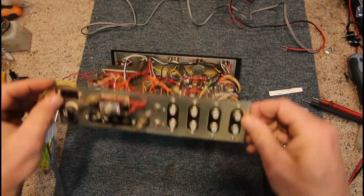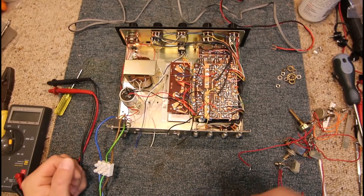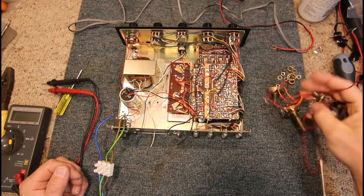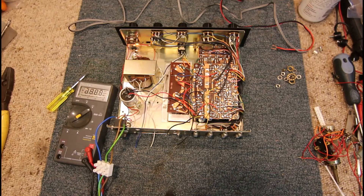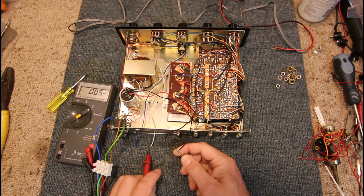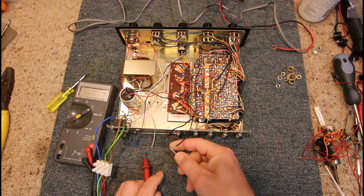I'm going to disconnect this and get rid of these potentiometers and stuff if I can easily do it. I'll find some pliers. Okay, so I've removed all this jumble of pots, switches, resistors and 3.5mm sockets off the back of this amp now. I've got power back on it, so I'll double-check the outputs. I've just got the output wires stuck out through the back — there are a couple of earth wires as well. We've got 12 volts on one and 12 volts on the other, so that's probably just the capacitors charged up.